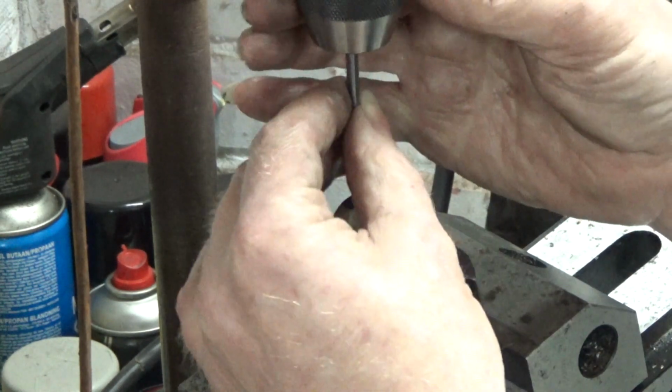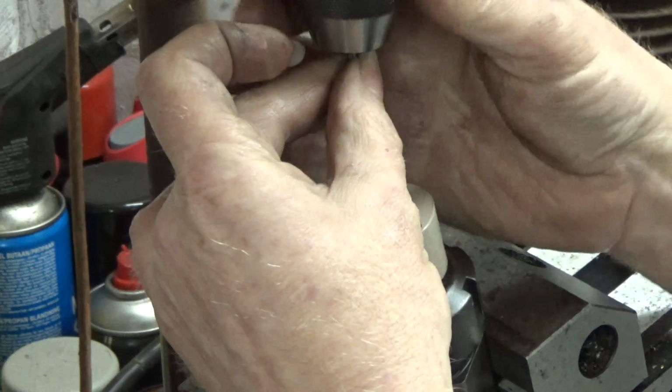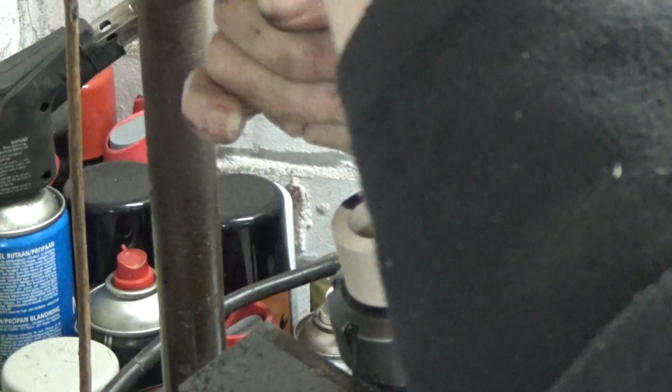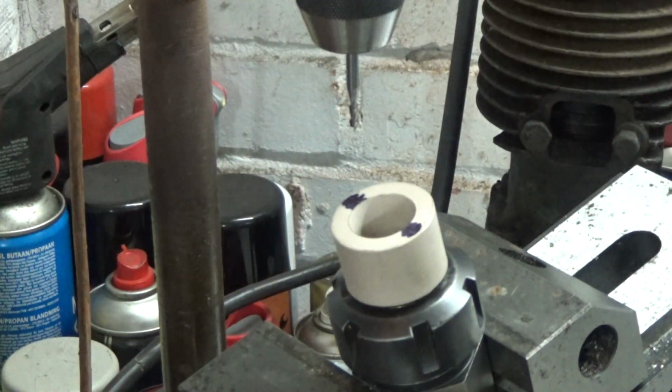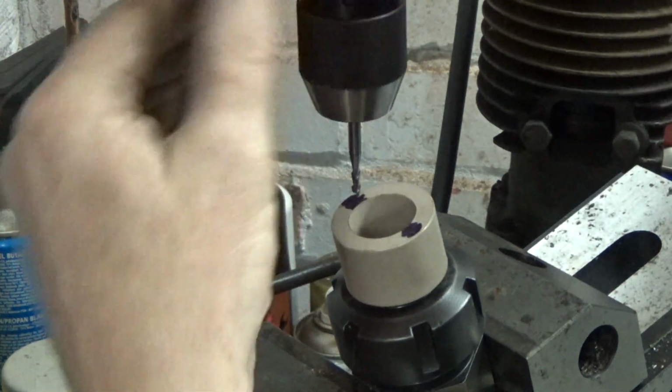I thought that I had a 3mm milling cutter with a 3mm shank, but could not find it. So I ended up using one with a 4mm shank to start the holes. I then drilled through at 2.9mm and hand reamed to be a push fit on the dowels.